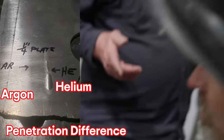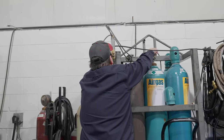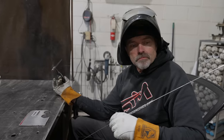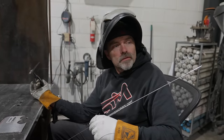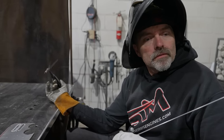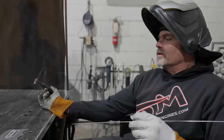Okay, now cool. Hang on a second. Let's see if we can do this. I just want you to listen to the gas frequency, the sound difference. Okay, hit the pedal, but don't put that torch on anything. You just want to purge that gas out. That went helium. Yep, and then you hear argon. Okay, so now we're going to go the opposite way. I want you to listen to it. Hear that difference? It's almost the difference you hear in the frequency while you're welding. It's that much pitchier. That's what the helium does.